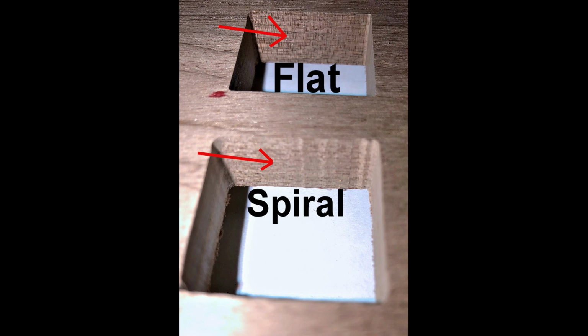So in closing here, I recommend that you learn to use both blades and when to use them and use them to their advantage. Now, most of the time, for most scroll saw patterns, you do want to use a flat scroll saw blade. You just won't get the quality of cut with a spiral blade that you will with a flat blade. But in those instances where you have a larger board, the spiral blade might be your only option. And for a lot of portrait style patterns, the interior cuts you're